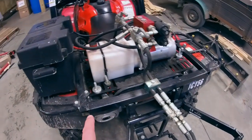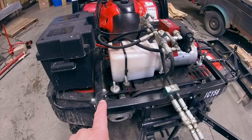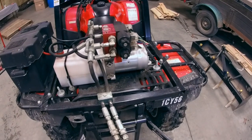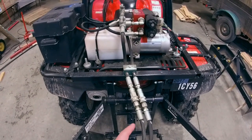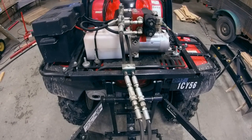The upper frame is attached with four U-bolts — one here, one here, one here, and one here — and those bolt through the rack. After that, the hydraulic hoses that come with the three-point connect right into the auxiliary hydraulics with quick-connect couplings.